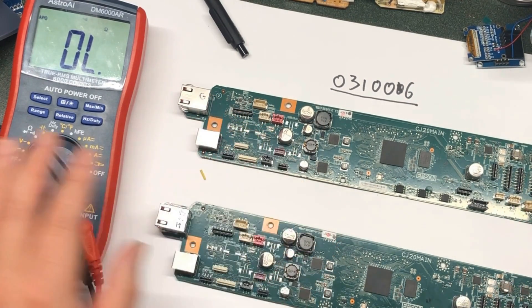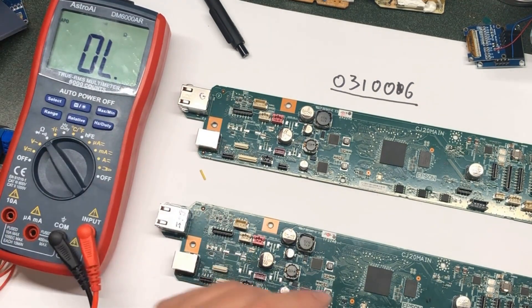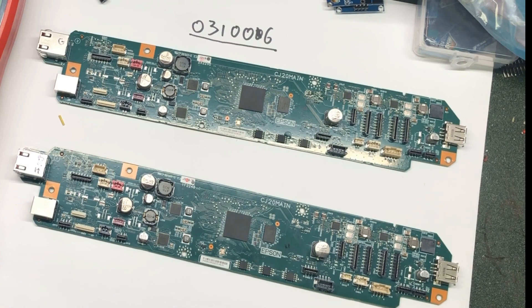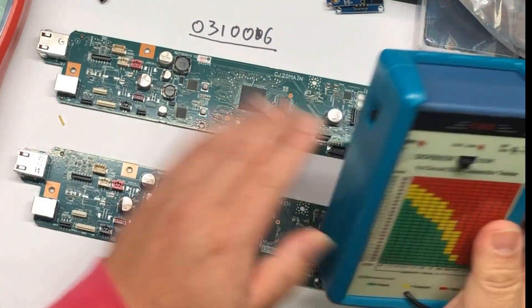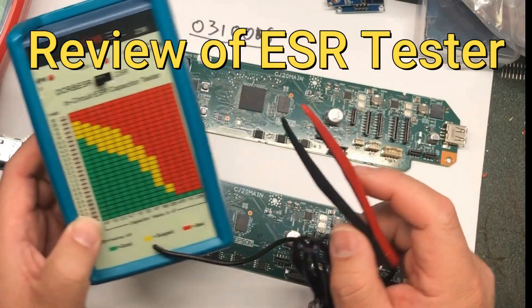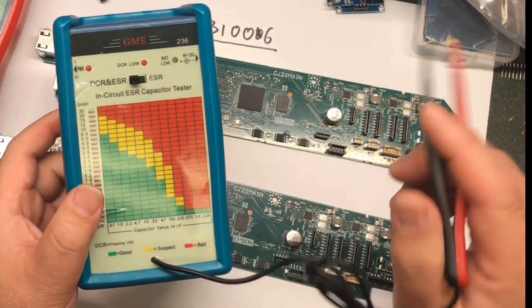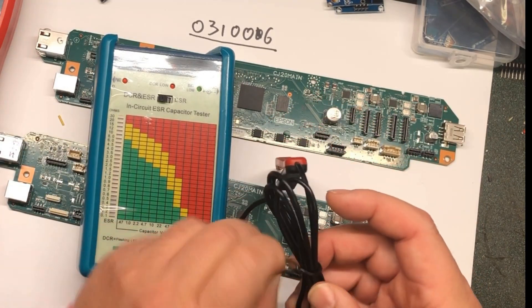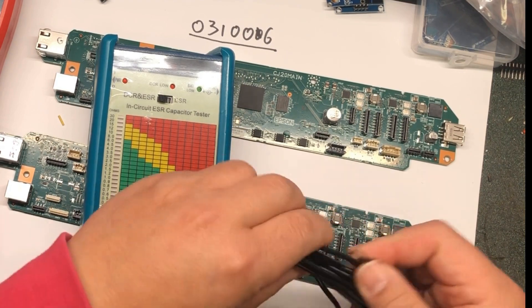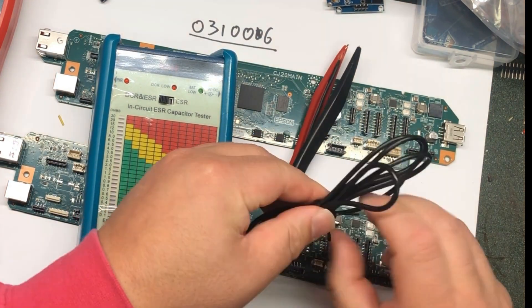However, if you are in a repair shop and there are lots of capacitors, the quickest and easiest way is using an ESR tester. The ESR test is the equivalent series resistance test. The beauty of this is you don't have to remove the capacitors — you can just put it in circuit and test it. This kit doesn't use two prongs; it uses tweezers, which is nice because you can use one hand. It also uses beeps so you don't have to look at it. The higher the ohm value, the more beeps you're going to hear. The whole thing helps you streamline and measure fast.